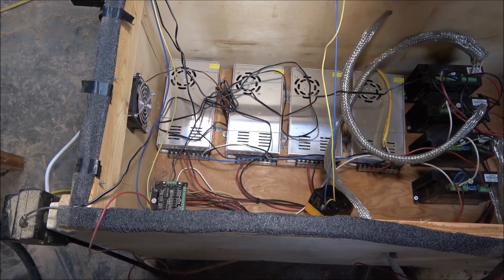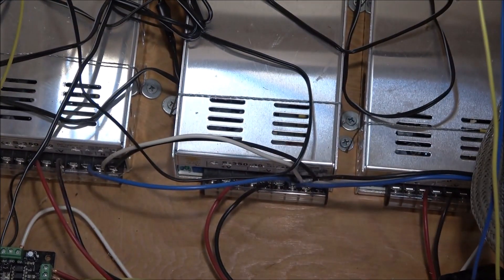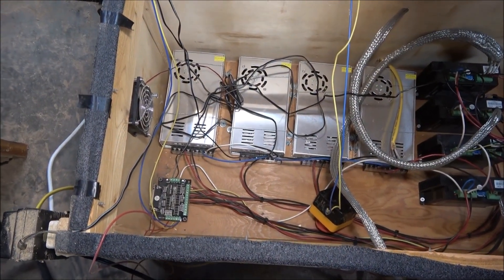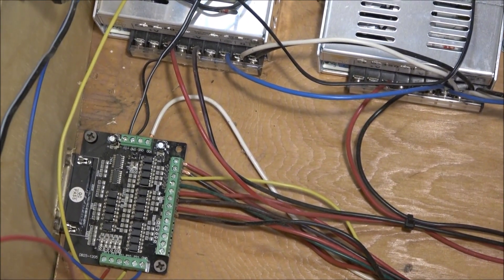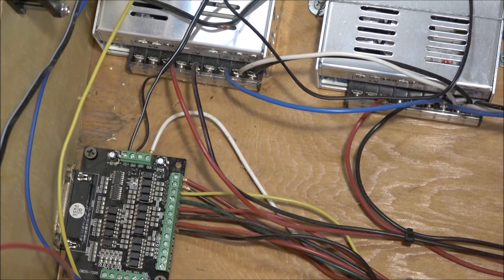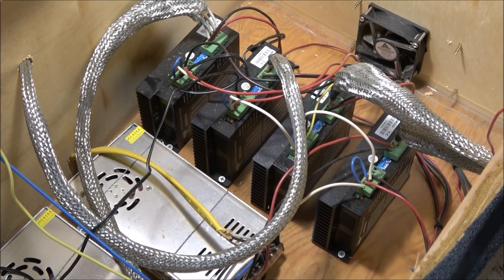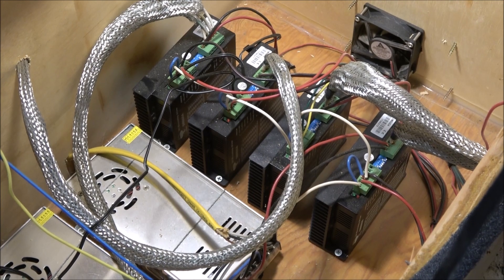What we're looking at here — the silver things are controllers. If you'll notice, all of these are wired pretty much the same. I have four of them because I do have four motors. Right up here in the corner, that is the breakout board, which you'll hear called the BOB. This is basically what transmits all the information from the drivers to the computer program to make it do what it's supposed to do. These are your drivers; they too are all wired pretty much exactly the same. There are an extra couple of wires on the Y-axis because I slaved one motor to the other so they would turn at exactly the same time.